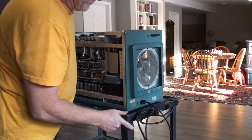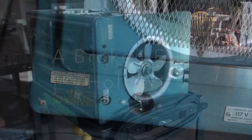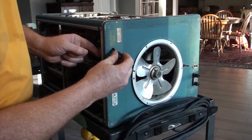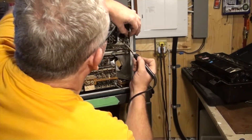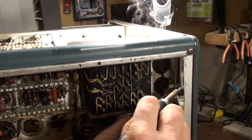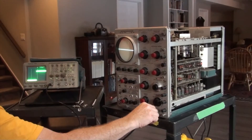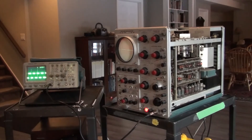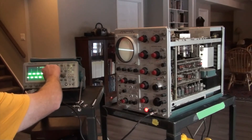So we're plugged in, and what appears to be a broken fuse holder. After replacing the fuse holder, I powered up the scope. The calibrator output on the 545 Alpha works fine. I do have a horizontal trace on the Bravo channel, no horizontal trace on the Alpha channel, and no vertical deflection on either channel. So lots more to troubleshoot on this scope.